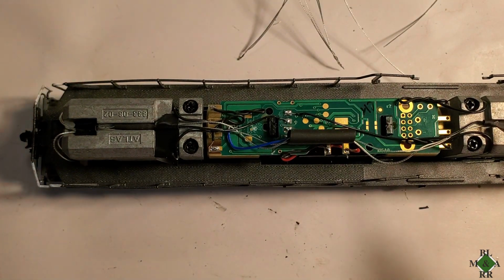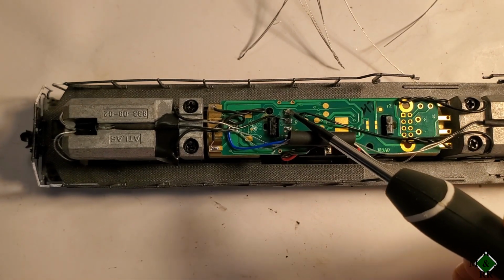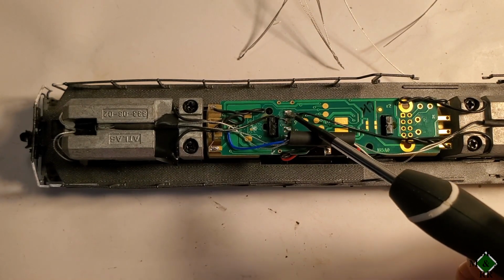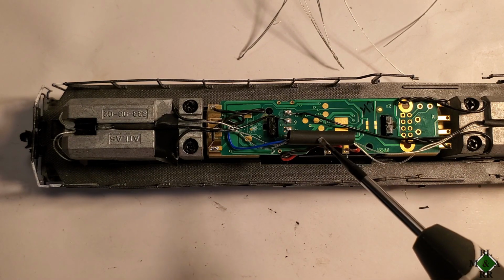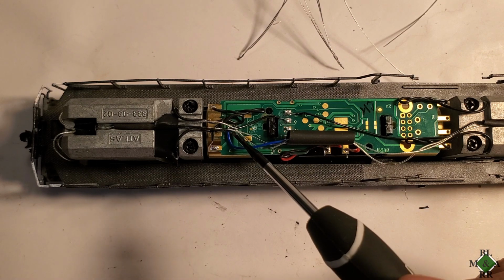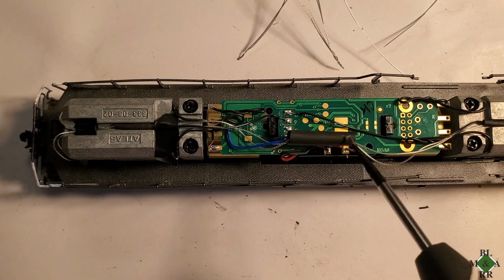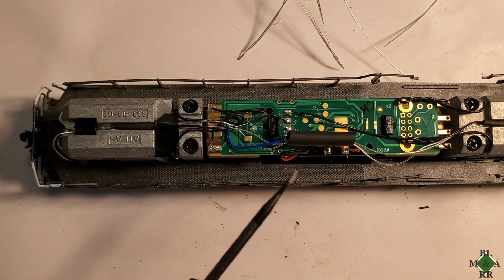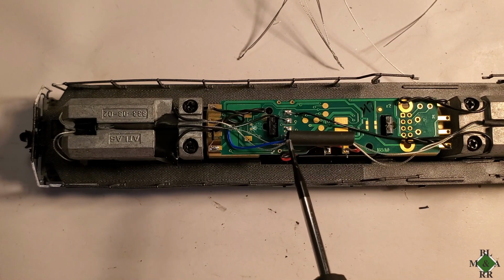And then the cathode negative side comes up here to pad number 4. The anodes come to here. That's the blue wire that goes to this pad right here. It's back here if you can see it. This is going to be a pretty big junction here, with lots of different commons coming into here. So this is going to be a big junction.